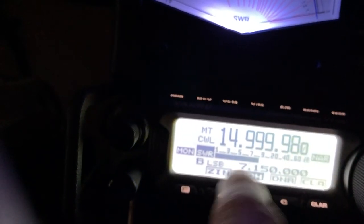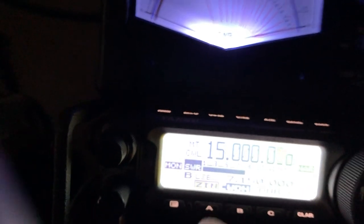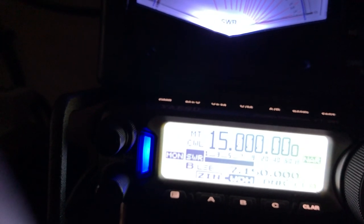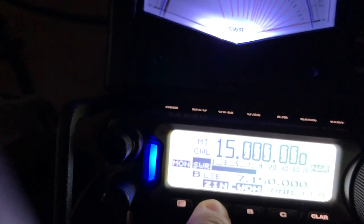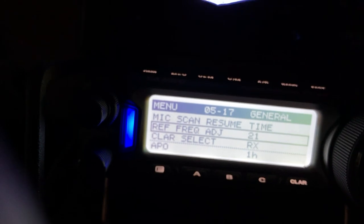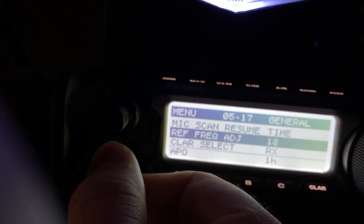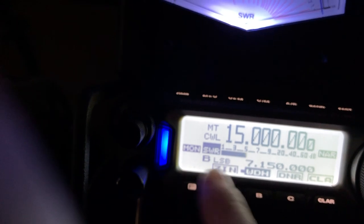So what if I get a little off? I'm going to press the zero-in — tap it until you get a blue light. You're locked on. But I'm still within a few Hertz of being dead on it. So I'll go back into this menu and come down a little bit. That's definitely going the wrong direction — if I get out and check it, it definitely went the wrong way. Hear how fast the heterodyne is there?